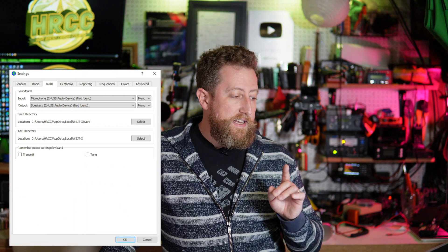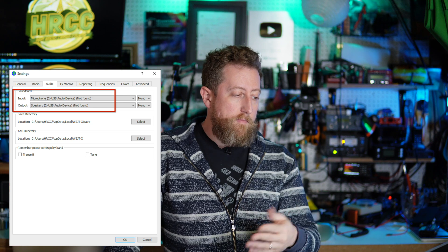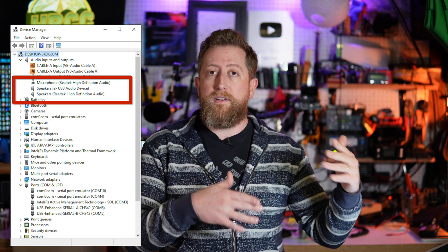Now that you've done that, go to the Audio tab, right next to Radio. Set it to USB Audio Device for both microphone and speaker. Click the dropdown — you'll see Microphone (USB Audio Device) for input, and Speakers (USB Audio Device) for output. You may have multiple USB audio devices connected, so you can do the same unplug/replug trick in Device Manager to watch which devices disappear and come back. Those are the radio devices you need for both speaker and microphone — you must have both sides to receive, decode, and transmit FT8 or other digital signals like Winlink.